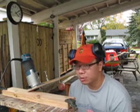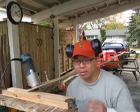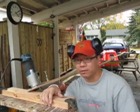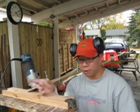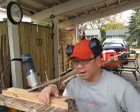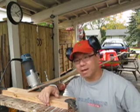One of the things that most people don't realize is that on the back of a guitar, even a ukulele, it's not exactly flat, but there's a curvature to it, and in most cases it's about a 15-foot radius. In order to build that in, what you need is a template with a 15-foot radius arc. I've tried several times doing it with a bandsaw, not very smooth, and so this is my last ditch attempt at doing this with a big compass.